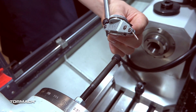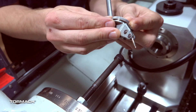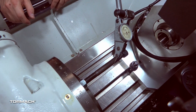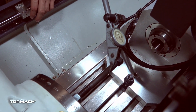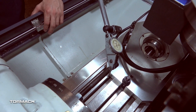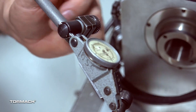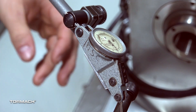From that point, I'm going to zero my A axis in PathPilot. Then I'm going to engage my indicator and set my indicator dial to zero. In PathPilot, I'm going to rotate A3 — it's going to move away — and then I'll go back to A0. Now it shows the backlash on the indicator. I can see that I'm right about three thousandths of backlash.